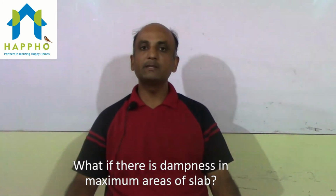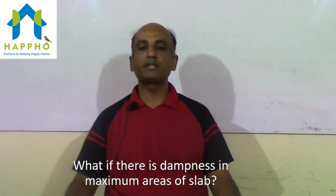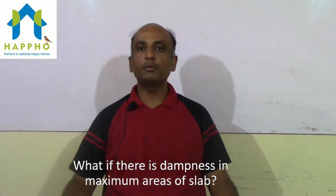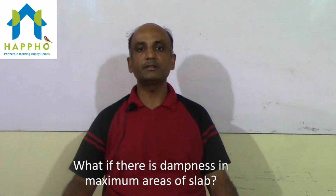If the entire slab is leaking, it is strongly suggested that you remove the entire top screed of the slab and go with the waterproofing build-up as explained earlier. Redoing the entire waterproofing on the slab can be very cumbersome. There is an alternate method to this.